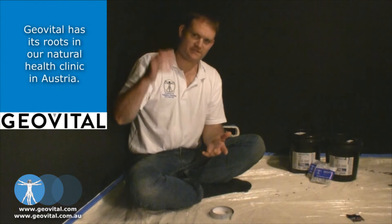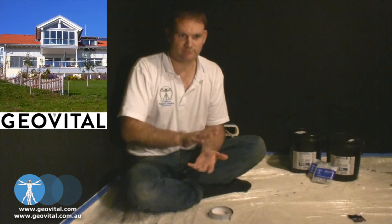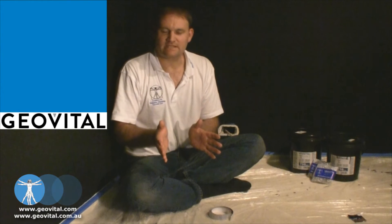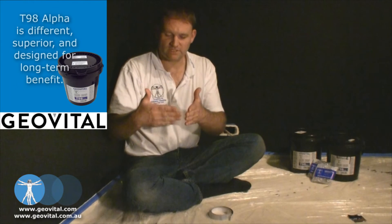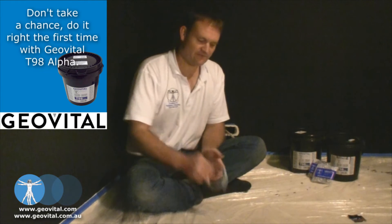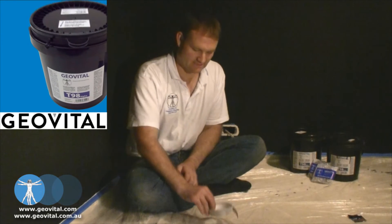If you were two or three stories up, our consultants would have talked to you about the possible need to shield that floor as well. You're basically creating that circuit to keep those panels electrically connected. Sometimes little cracks appear in the corner between walls, which may sever that electrical connection, but having that tape jump from one side to the other keeps those panels electrically connected. That tape is connected to ground somewhere, and you can do that in one spot, effectively earthing all those panels.